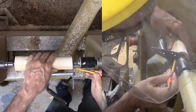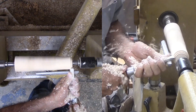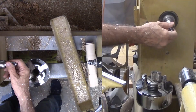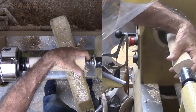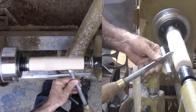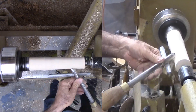This wood is a hazelnut sucker. As usual, after a minimum of roughing, it is time to cut a tenon sized for my smaller chuck jaws. My favorite tenon tool is my skew. Now I can finish my roughing cuts. However, I do not need the entire length. My bowl gouge is most convenient for this task.